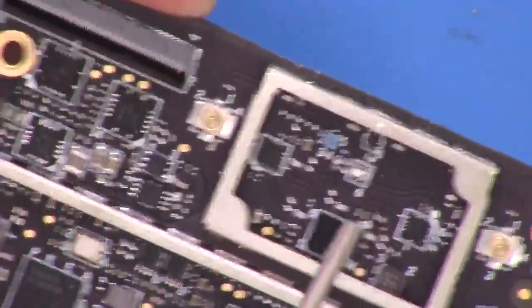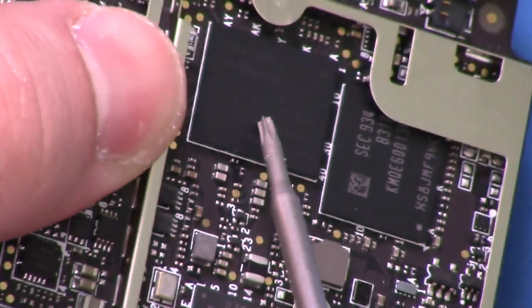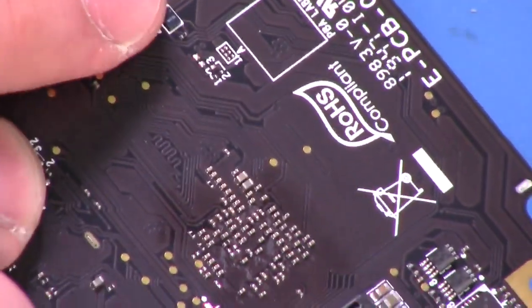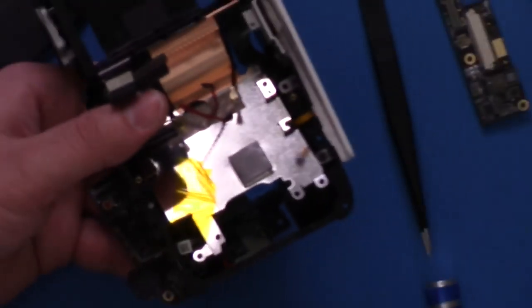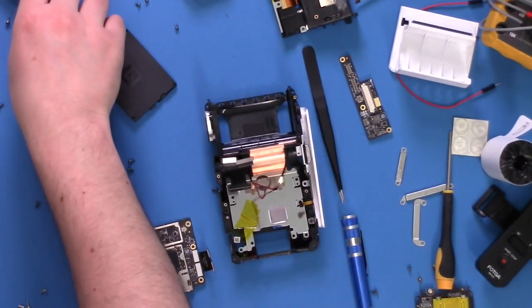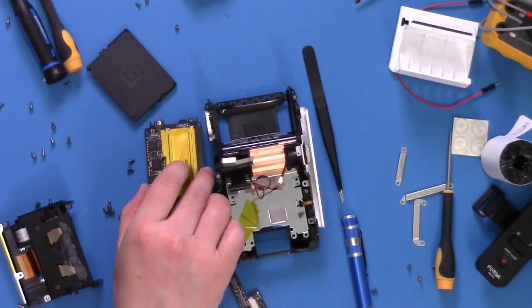Up here, this looks like power management - just all the inductors kicking around it. Qualcomm as well, but that's kind of power management. There are a lot of test points and stuff, so there could be some interesting stuff to probe at - interesting to see if you get a serial console. Here's the Qualcomm SoC, and right on the other side all the decoupling capacitors pressed into the case for heat dissipation. So that's everything that's in one of these Square readers.